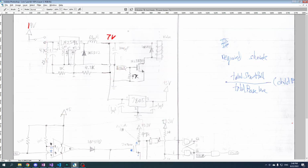So let's talk choices. Why 7 volts? Well, the valve here is rated at 12 volts DC, but I found that I could actuate it reliably down to 7 volts, so that's the voltage I chose. Obviously with lower voltage we have less current and less power, so I said, let's make this thing more efficient. We'll run the solenoid for the valve at 7 volts.